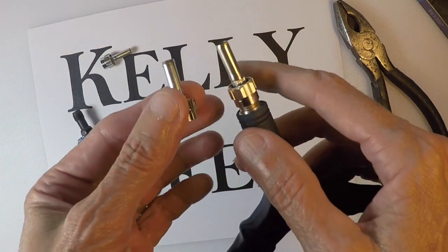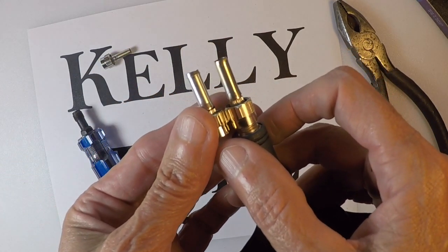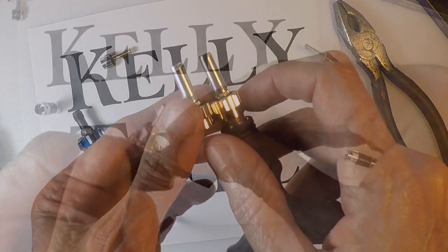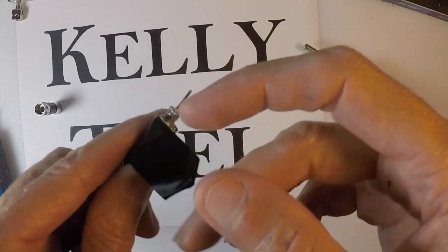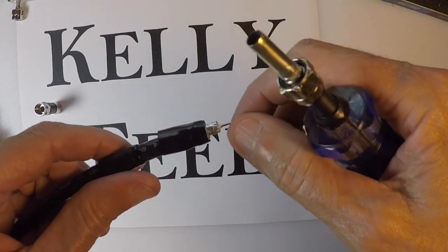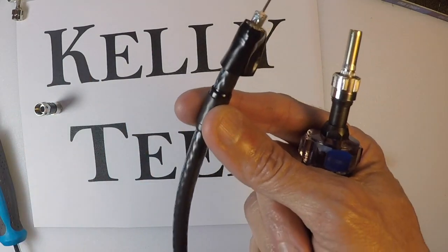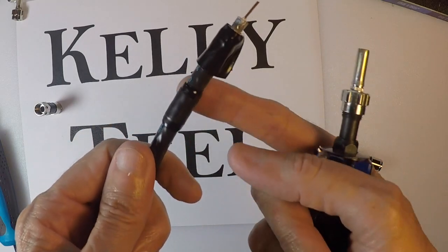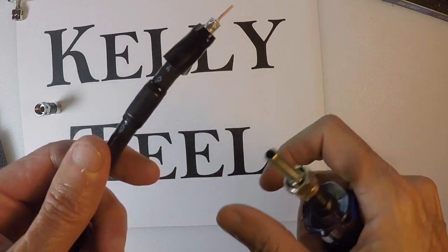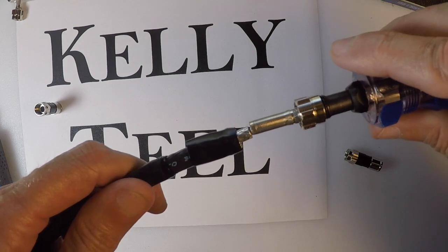You can see here, this one hasn't been smoothed out, and there's a little bit of a barb on it — a little bit of a flare right here at the end. This holds those braids in place and keeps them from being pushed back down under the jacket. If you're having trouble holding onto the cable, you can put a bump of electrical tape around it back here. Just make sure you put it back far enough that it's not going to impede your F connector.